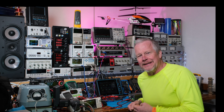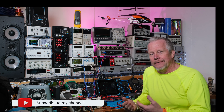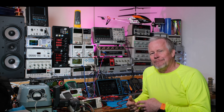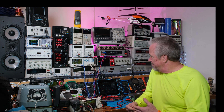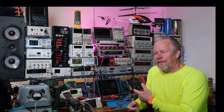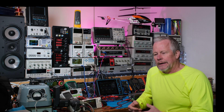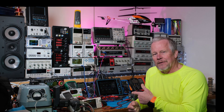After looking at that waveform, you can see why you don't want a modified sine wave inverter. You want what some people call a pure sine wave or true sine wave — a nice clean sine wave output — because that chunky waveform won't play nice with a lot of electronics. These days pure sine wave inverters are very inexpensive, so if you see an inverter with a very low price, make sure it explicitly says pure sine wave. Avoid modified sine wave inverters.